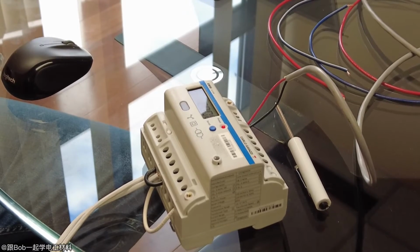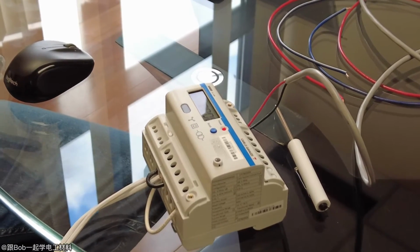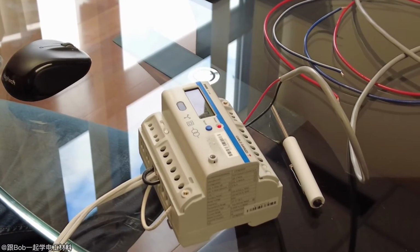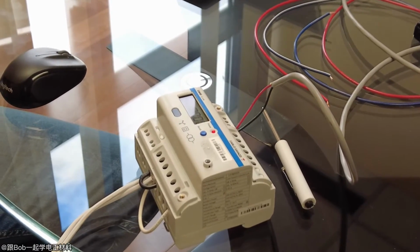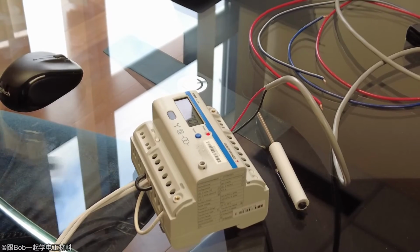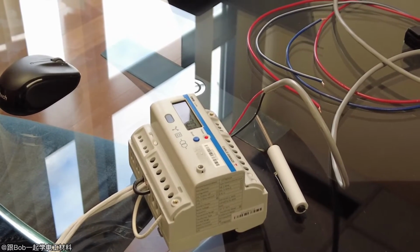Right? That's the only difference. With the other one you have to use the bigger current transformers, CTs, whereas this one, because you wanted to match that other system that had all the CTs, went together as a package. So that's why we suggested the 80 milliamp for that one.